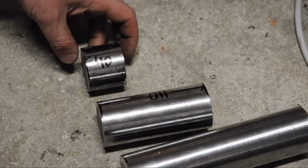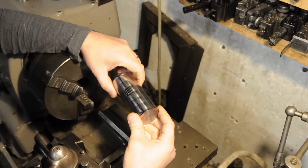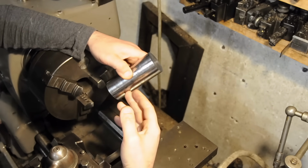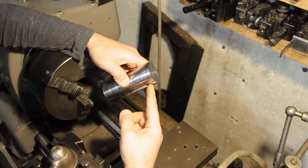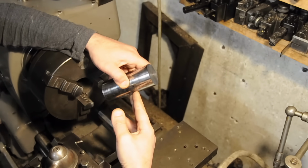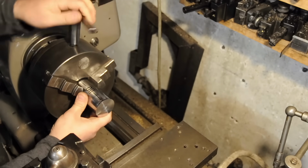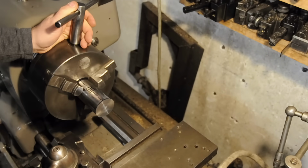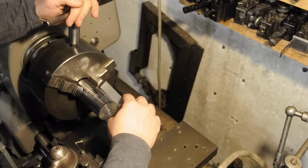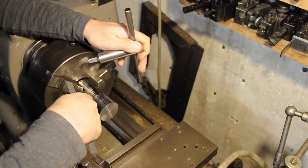What are the odds? So just like every other great story in history, ours is going to start off at the lathe. I've got the 110mm blank. This is going to be sort of the body of the boring head with the integrated arbor. If you watched my mill tooling video, the first steps here will be essentially the same. Dimensions at this point aren't super critical in that we can, to some extent, make them up as we go along, but concentricity is going to be a big one here. You wouldn't want your boring head all off-center. Wait, that didn't come out right.